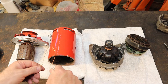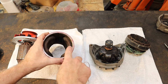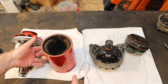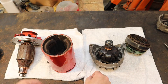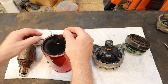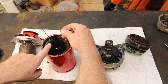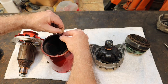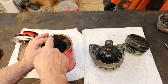Now the thing about this is that the electricity induced in this loop of wire is actually alternating current, because if you look in here, you'll see field windings, and these are stationary. When the generator is generating electricity, there's a small amount of current put through these two electromagnets, which creates a magnetic field that is stationary and goes across this space. And the loop of wire, which is over here on our armature, is spinning inside that magnetic field. Now if you think about that, on one side we're going to have a north pole, the other side a south pole. As the wire turns through the magnetic field, this side is close to the north pole, then when it gets to 180 degrees it's toward the south pole. So what's actually happening is this is creating alternating current in the loop of wire.